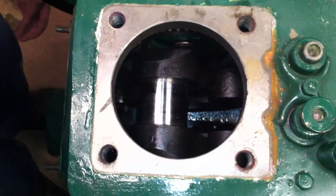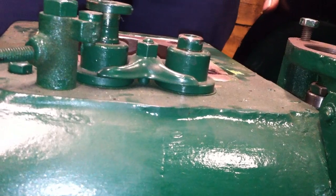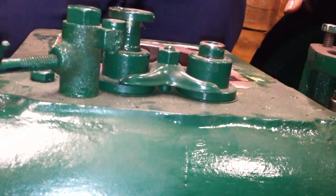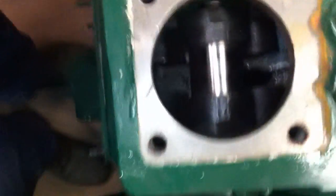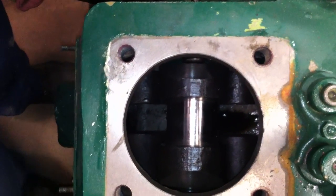And again, when you're double checking, don't look at the crank — only look at your lifters. Guess where you have your lifters split. Those of you that happen to have a dial indicator or two in your shop can do this scientifically. As you can see, we can do it with the eyeball. Right there, we are split — we got one going up, one coming down. Going to look one more time in the top. The crankshaft is centered in the bore. This Listeroid is in time. Thanks for watching.